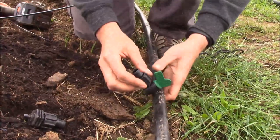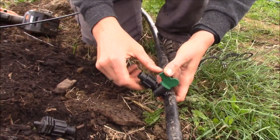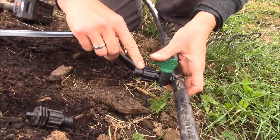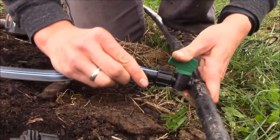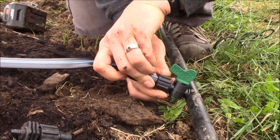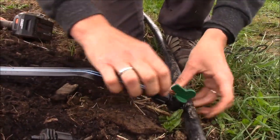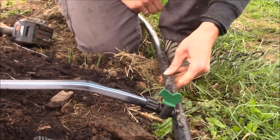Now that the valve is set, you'll notice these valves screw on and off — you want it in the full open position. Take your drip tape, pop it open, stick it on there, and get it over that first ridge and then over the second ridge into the well where the twisty part is. Then just twist it down tight, and that's it. Your drip tape can't pull out, and you've got your valve to turn on or off as needed. Hopefully this can make your irrigation journey a little less painful. Having everything on drip tape is a huge win — it takes a lot of thinking off our plate. Anyway, thanks for swinging by the farm. We'll see you next time.